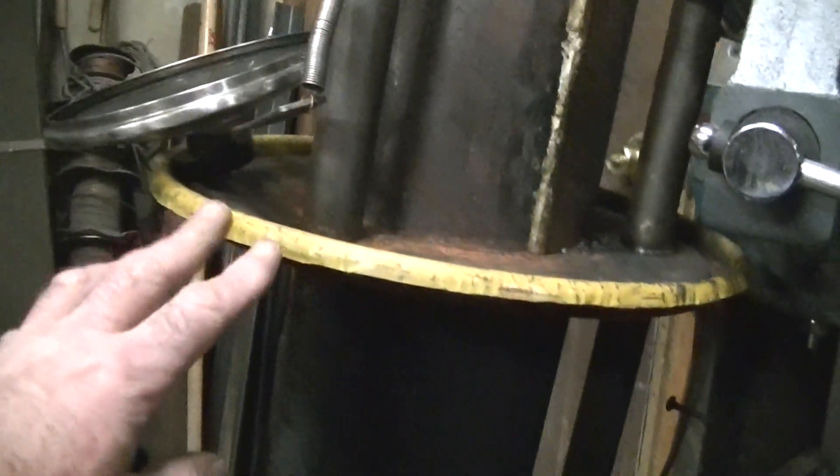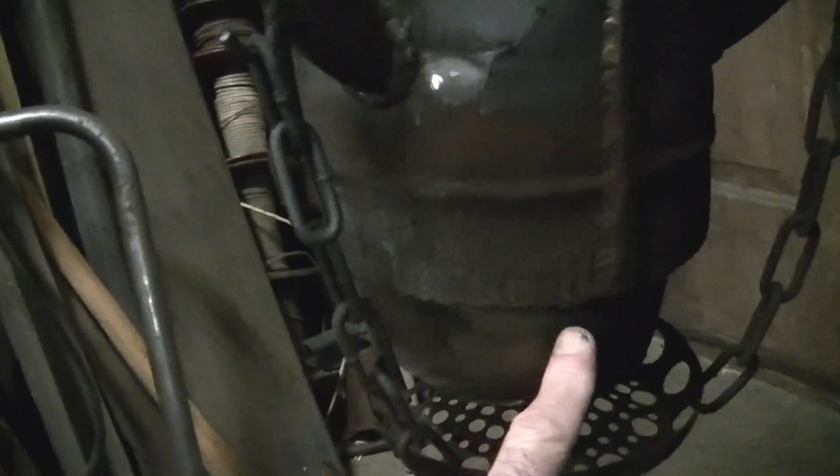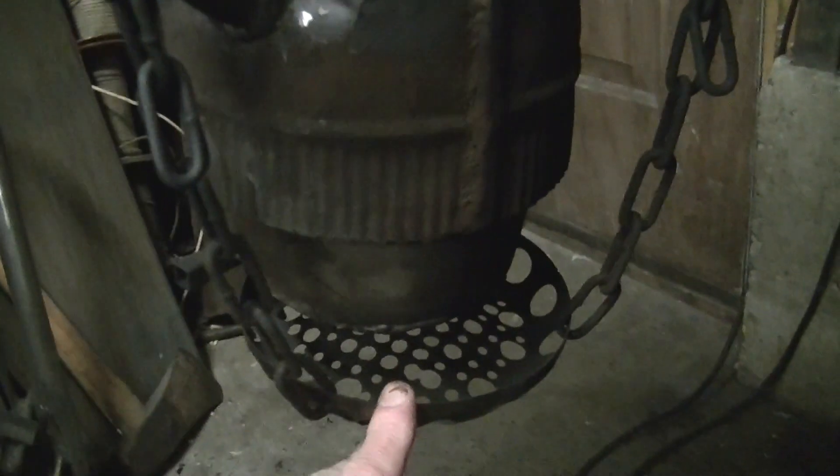What I've got is stovepipe — stainless steel — and I've put some air tubes down through a lid of a 60-gallon barrel. They come through on the sides; there are three of them. On the bottom I've got a stainless steel bowl right here, and I brazed it together using brass brazing rod. I also brazed the seam of the stainless steel stovepipe.